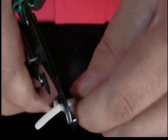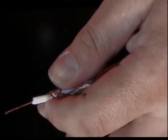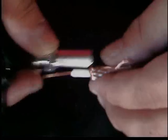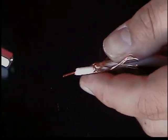Let's see if that did the trick. Let's try to give it a better cut — not too much, you don't want to cut that conductor. There we go. That looks a little too long, so let's go ahead and cut a piece of the center conductor off here.